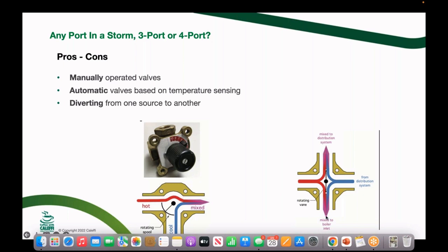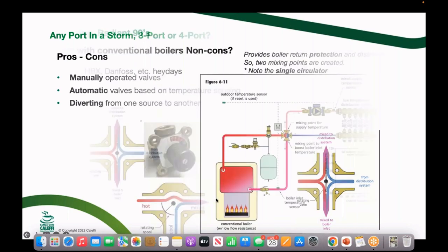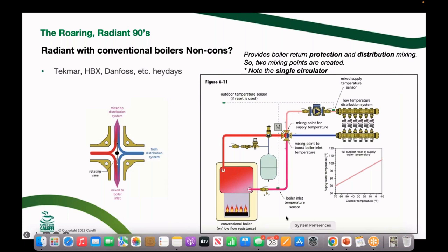With a high-mass radiant system, we want to make sure that connecting to a cast iron non-condensing boiler we protect the boiler from running too cold on the return temperature — from condensing and destroying the boiler, flue, and other components. The control watching both conditions will prioritize keeping the boiler from getting too cold. In a typical drawing we have a sensor on the boiler return monitoring that temperature, and the valve moves its internal vane to ensure the blending point stays warm enough for return protection.